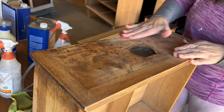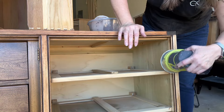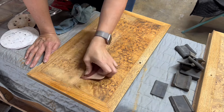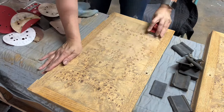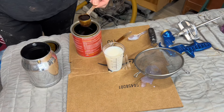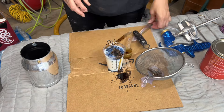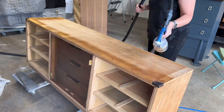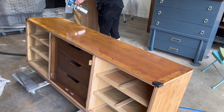You can also use acetone. With Burlwood, it doesn't really have a direction, so you just pick the direction you want to go and make sure you stay consistent. On the drawers, I decided to go horizontal. On the doors, I had a strip around the edge, so I had to be really careful to go in the direction of the grain, then I went vertical with the doors. On this one, I decided to just simply tone it because that Burlwood was beautiful. So I'm mixing a little bit of dye stain in with a top coat — this is General Finishes High Performance Top Coat — about 10%. It's just going to put a little bit of tone on your dresser.